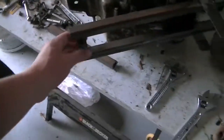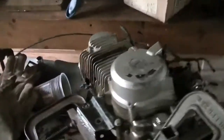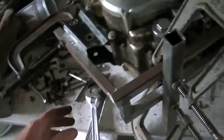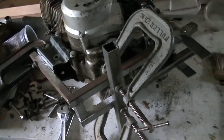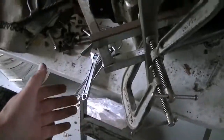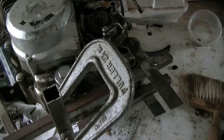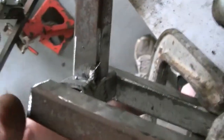I'm going to go ahead and get this piece tack welded to there and see what I can do with that. Now this setup is a little bit more complete. I've got things clamped in place just for now, everything cleaned up so I can do a few tack welds here and in there just to hold it together temporarily and see if everything will fit. I have this guy clamped across here to make sure these two bars are parallel, and I've got it all aligned. It might look a little off because these links are slightly different — I'm going to shave them down once I'm done. I have a hacksaw and an angle grinder, so there's not much precision I can work into this. But basically it looks like it's going to work.